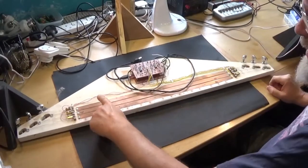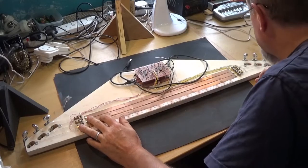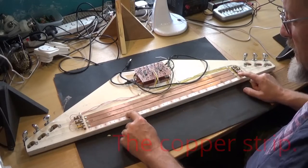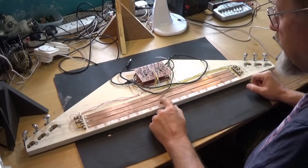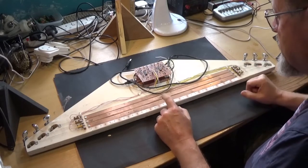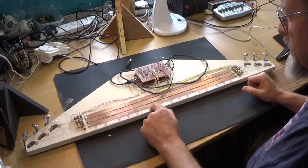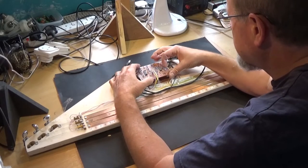This other one has three strings made out of stainless steel wire, which is sold to repair the heaters in e-cigarettes, but it does this job. We're putting current through the strings and this acts like the wiper on a pot — if you do this, you get a voltage output, a little thing to tell you where the notes are. These are just cheap guitar machine heads to keep the string tension. It worked okay, though the action is a bit high above the fretboard and the copper gets a bit tarnished.